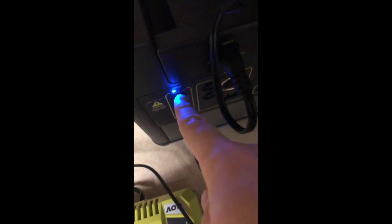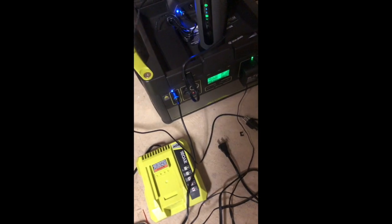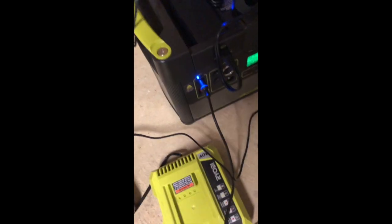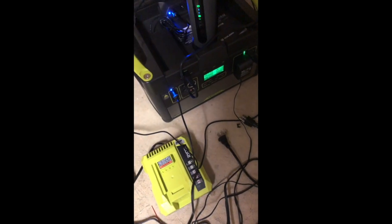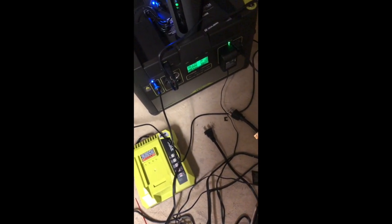It does come in through this line and it's connected to their PWM. I may want to try their MPPT, which supposedly gives you about 10, maybe 15 more watts if it's ideal. I'm also using this crummy 16 gauge cable that they provide — you may want to change it to 12 gauge, which is thicker and stronger.